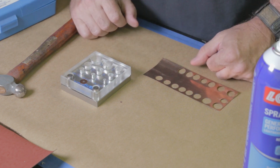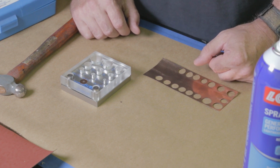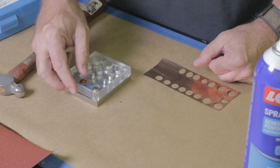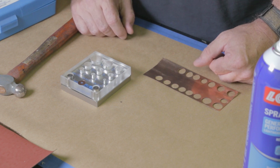I've tested it and used a 3/8 inch shim on each side, and then switched out to a 1/2 inch or a 5/8 inch shim on the off side, and found that it does help. But that only helps with everything else being right. If your tolerances between your back spacer and your blade and shim stack are off, that's not going to do a whole lot to help you out. So just something to consider when you're designing your knives.